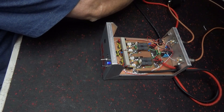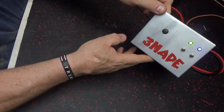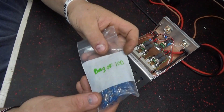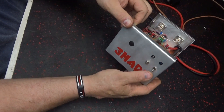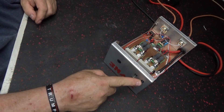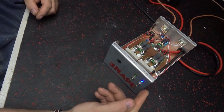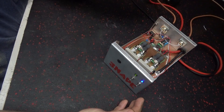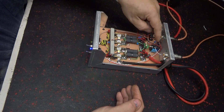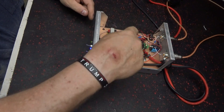Alright, let me hook the power up. Like I said, what it was doing before — I could turn this switch on, it's a green LED. It's bright when you look into it, but it's a different kind — this one is blue to start with, this one's clear and it turns green. When this power comes on, this one's on, but when you turn this on and this one off, it would illuminate that one even though the power was only coming from here over to there. It was sending signal back through that cap — which I don't see how, because it's got a blocking diode there to keep it from going that way, but then again this coil comes through on this side and can bypass that.